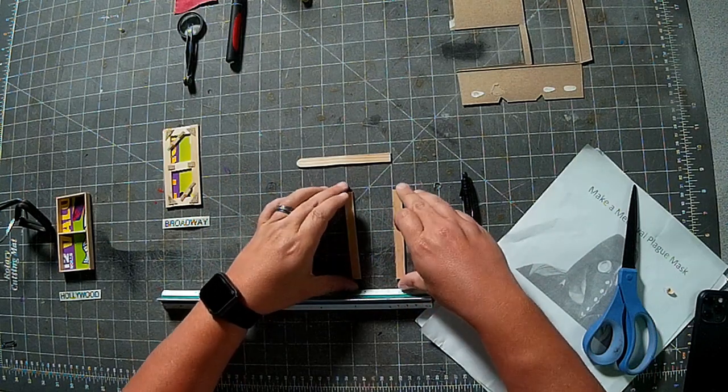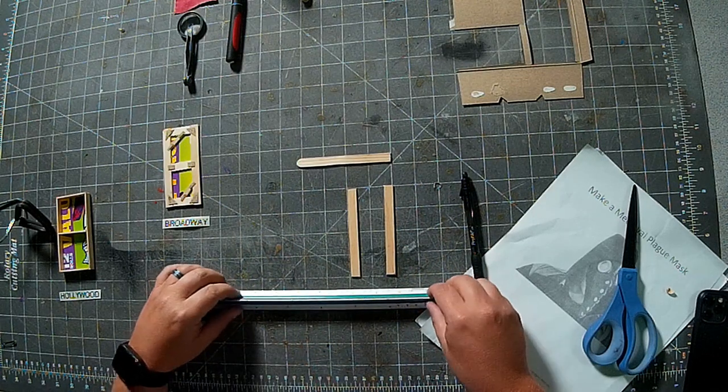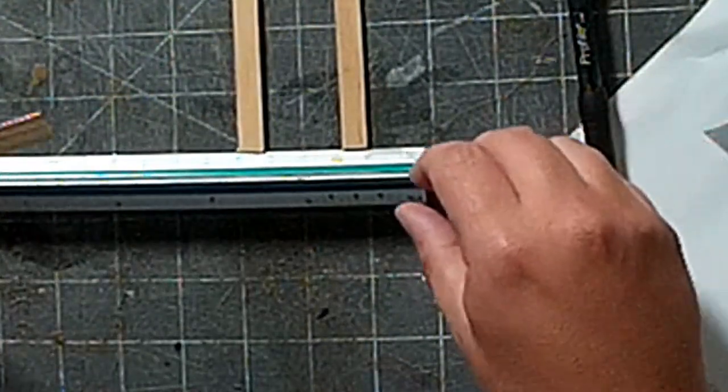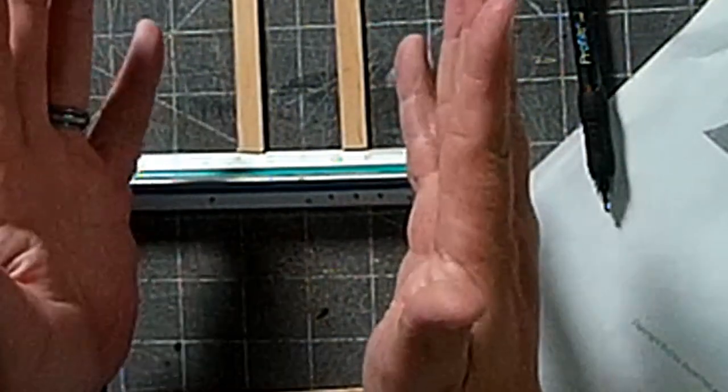Now, the flat that we're making is 8 feet tall and 4 feet wide. So on my scale ruler, you'll see that I have it set up at 4 feet wide. What I need to do is figure out the distance between the two so that my rails and toggle can be placed in the middle. To do this, I'm going to use my scale ruler. I've set up my two stiles at the outside edges at 4 feet apart, according to my 1/2 inch scale.